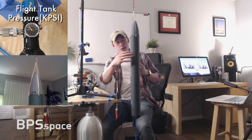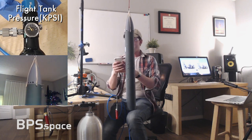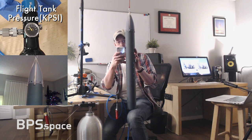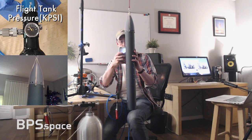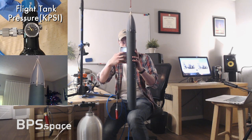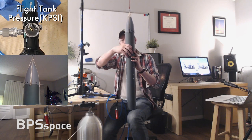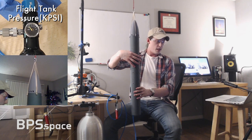So what I'm going to do is boot up the computer one more time. Well, more than once. I'm going to put the phone really close to it because the Bluetooth connectivity is pretty terrible. Okay, and then I'm going to change some of these PID gains so they're a little bit more sensitive. Instead of 10 degrees, we'll make it like 4 degrees. Okay, so let's try this again. I'm going to boot up the computer again with these new gains, and we'll see how it does.